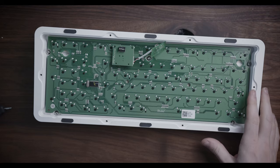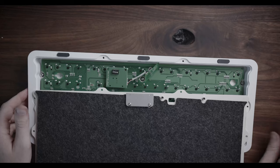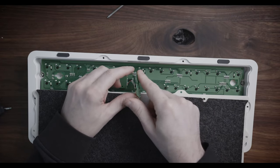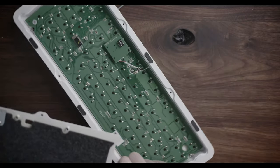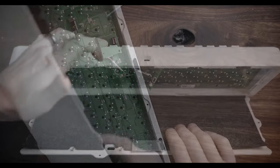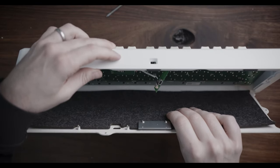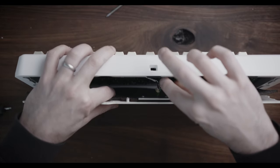Now, indeed, the tricky part. So what we have to do is use these tiny little screws and our tiny little hex wrench to attach this smaller breakout PCB to its position on the breakout PCB adapter plate. However, we have very little clearance in which to do that. So what I'm going to do is insert the plate in one end here of the plate well, the sort of lip that holds it in place. I'm going to get them as close as I possibly can.